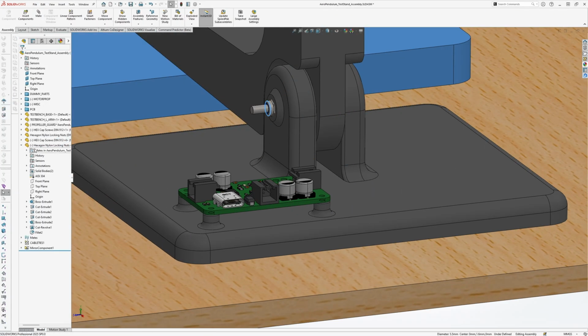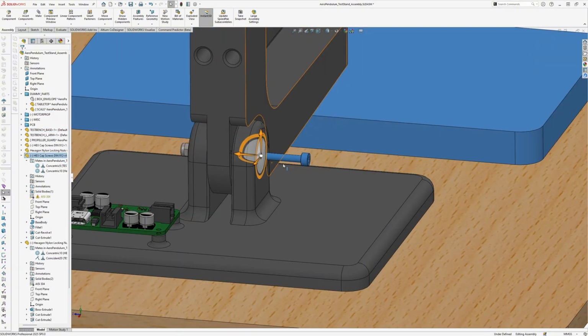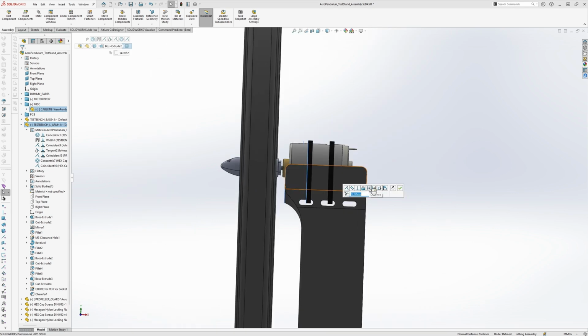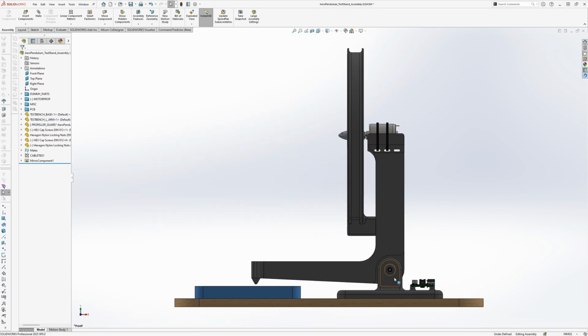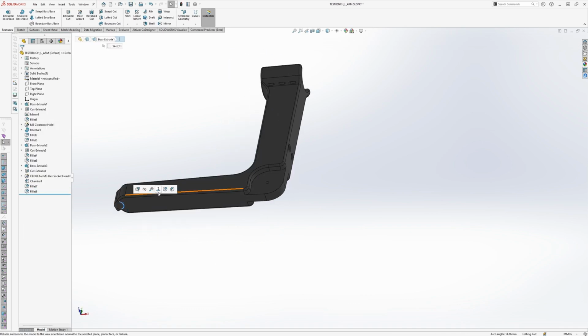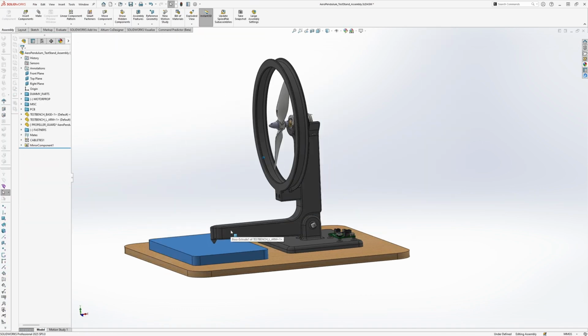To use the same nut and bolt in the bottom as in the arm, I just had to add a little bit of material on either side, which is fine. I then just adjust and check everything again and make sure that it works as it should. Then I'm just cleaning up the part, adding some fillets, and now I'll move on to the drawing.